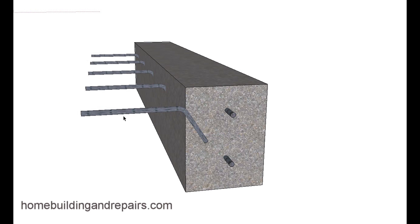Here we have the rebar bent at a 60-degree angle. I just wanted to give you an idea — I don't think it's good to go at a steeper angle even though it seems like it would provide more resistance under pressure. The whole reason for drilling at an angle and bending it is that it's kind of an alternative to using epoxy. If you just drill it straight and use epoxy, I have seen the epoxy hold — trust me, I've done some experiments with that stuff and it is definitely good.